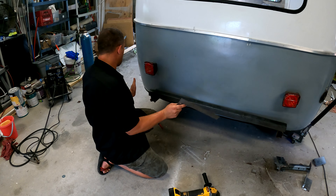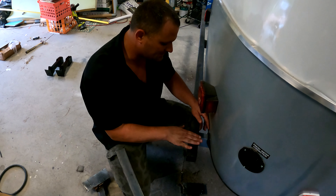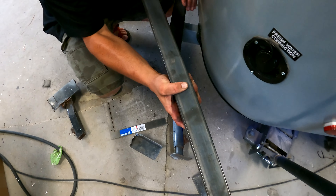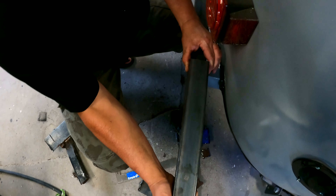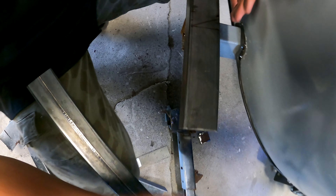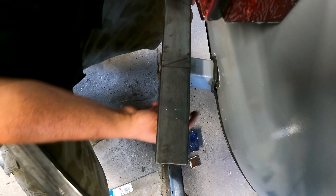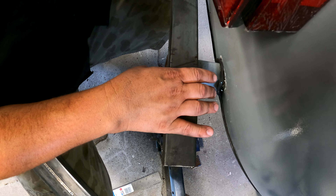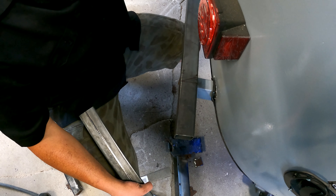The bumper will come out with a couple of little wings going around the corner. We decided those mitered bits will be about six inches. I've come a half inch off my bracket, and I'm going to take the tube, turn it to the angle we want, and trace it. I'll pie-cut this out, bend it by hand, and weld the seam back together so on the outside it's totally seamless and clears our brackets — same on both sides, cut to length with enough room for the centerpiece.